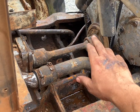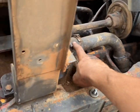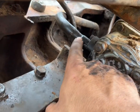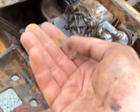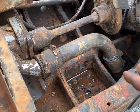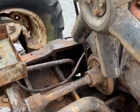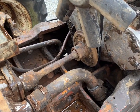We have everything put back together — these four bolts tightened, the hose tightened back up, four little allen-head screws, and there's a return line that comes out of this. We went ahead and changed the O-ring in there too. I've never seen the amount of dirt come off a tractor like this. It's nowhere near perfect but we're going to use it a bit and then clean on it some more. I put a new Gates belt on here, and Dad's been up to the house to get the radiator so we'll try to get that back on.